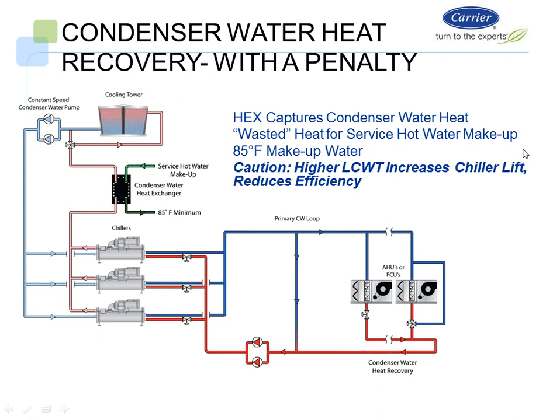So that does not allow me to do any relief on the condenser side based on ambient outdoor air temperatures. And as people who have listened to me and discussed our last chill water projects, our whole intent is to reduce lift on a chiller plant, so therefore operate chillers with cold condenser water. In this case, I'm meeting the intent of ASHRAE, but I'm not able to run my machines with cold condenser water, because if I run them with cold condenser water, I cannot provide 85 degree minimum out of that heat exchanger. So I hope that explains that enough.